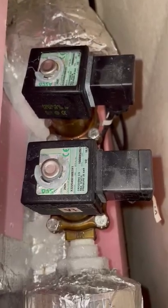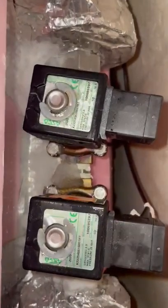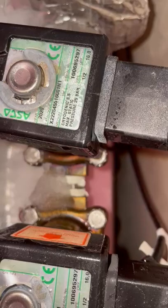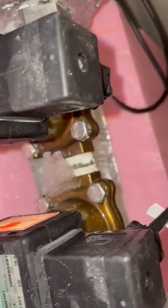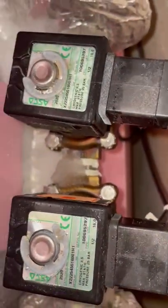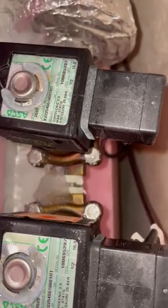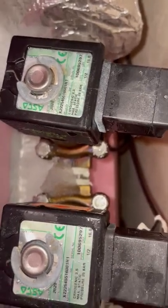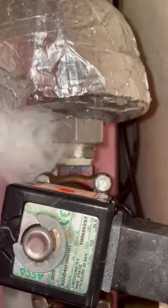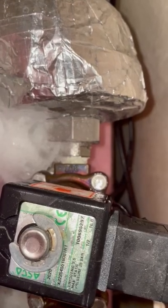Now, during a session, if your V1 or V2 is leaking — which these are your V1 and V2 — you'll see that in V1 or V2. This is your best view normally, because a lot of times in that middle you'll see where the brass seals are, where they clamp down — they'll often leak. Every time you hear it click is when you'll most likely see the nitrogen kick out. You'll click open and hear the burst through. At that point you'll likely see the nitrogen coming out. If there's a leak there and you don't see it, you can use video with flash on, let it run a little bit, and see if you see a leak.